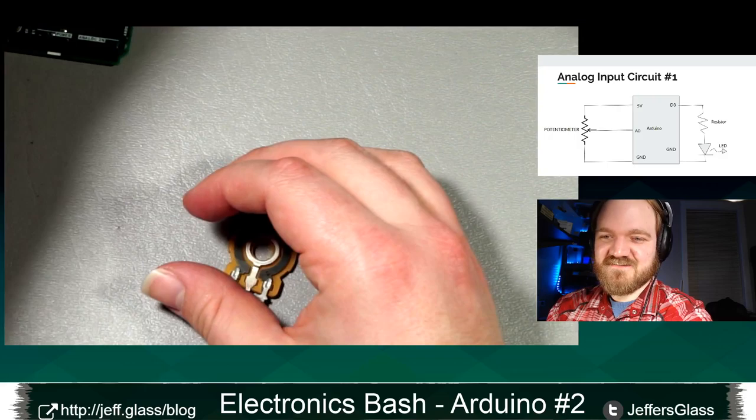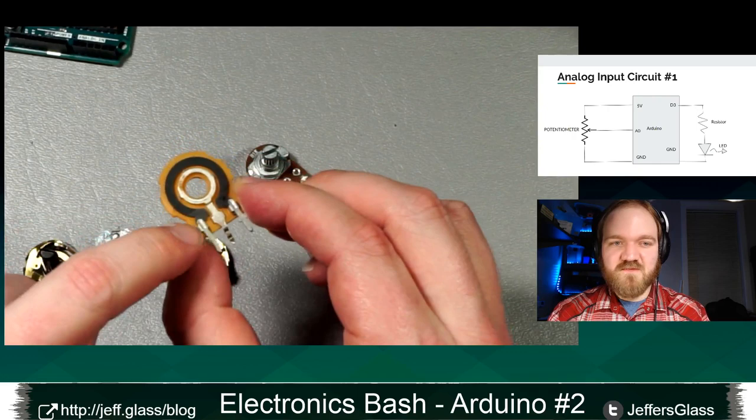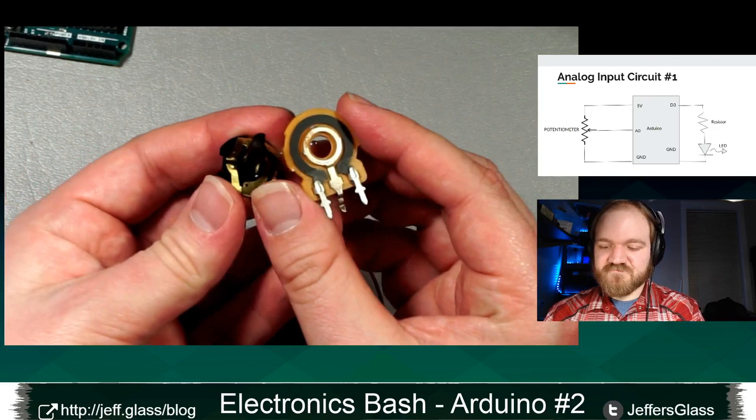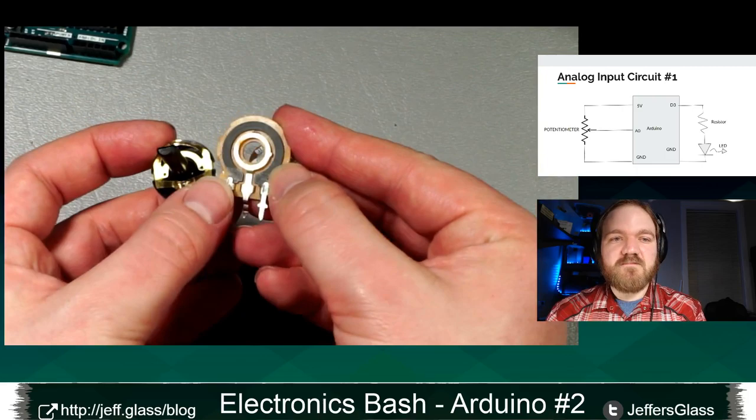here's what we have. The 3 terminals on the output side here are connected internally like so. You see we have the outer pins are connected to this strip of resistive material. It's similar to the material that's inside of a resistor that's doing current limiting. This middle pin here is not connected directly to that, but there is this little wiper circuit that it's connected to the knob on the front, so that as we turn that knob, this little nubbin there changes its position